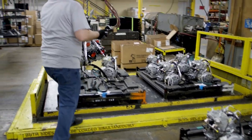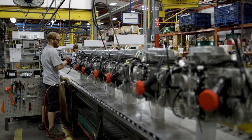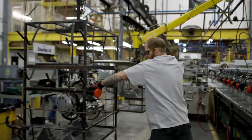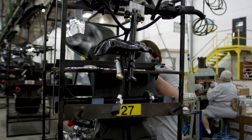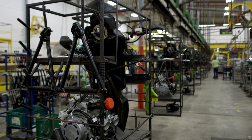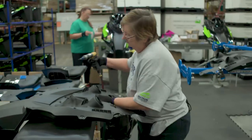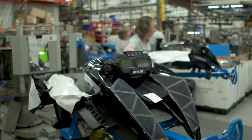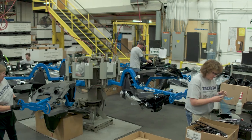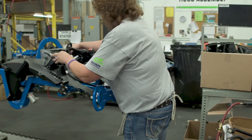The engines arrive and are prepped in the pre-assembly area. Bar-coded carts are loaded with the parts needed to build each snowmobile. This pre-assembly cart will make its way to the main assembly line and will track along with each assembly step, with the right parts just a reach away. The snowmobile hoods require an intricate assembly that varies from model to model. Using a rotating carousel timed to the pace of the snowmobile line, the hood assembly is completed.